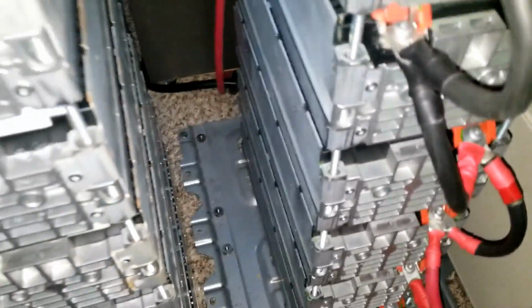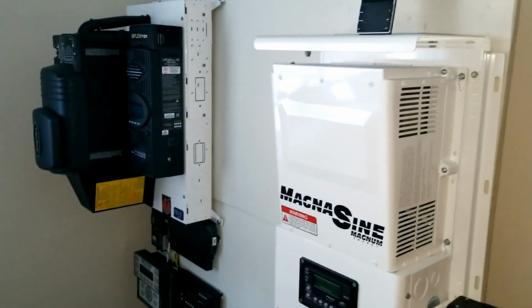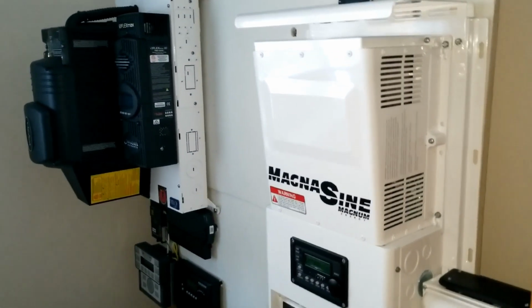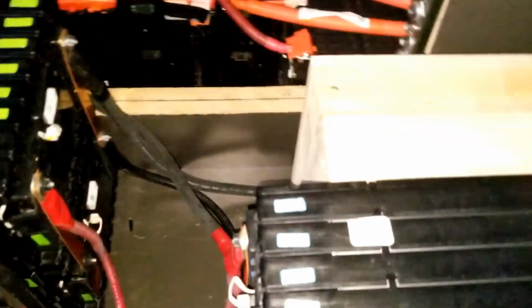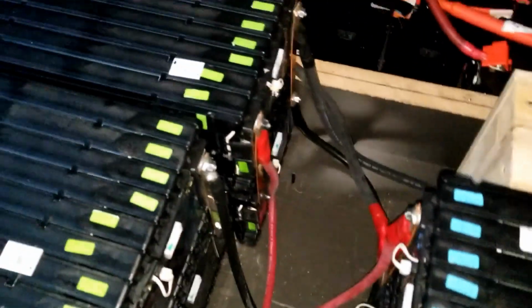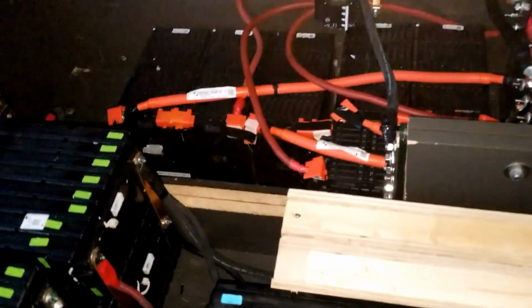It becomes a 48 volt. So I'm just going to take one and interconnect to this. It comes to 48 volt. Then we can use it with the Outback power. But Outback already has its own batteries, designed strictly for 48 volt configuration, which is here. There are the LG Chem, about six of them here. That's why they all have to be in parallel. You see the bus bar, positive to positive, negative to negative, because you can't series them anymore.